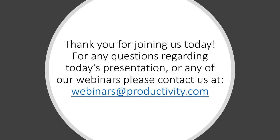9955 turns on the probe at the beginning as well as turns it off at the end. Do we not need the extra 9832 probe on commands? No, you do. You need it because you need to be able to do the protected positioning, and you can't do protected positioning unless the probe is on.